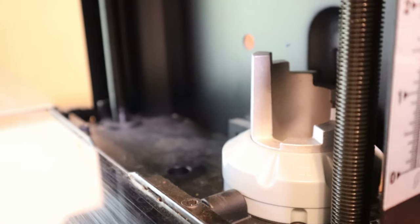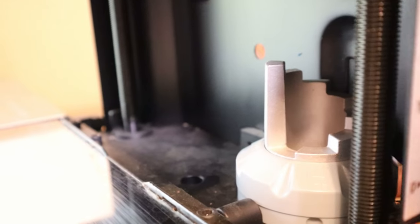Next thing is I wanted to show you the actual repeat depth of cut indicator mechanism. So this is the unit here. It's really solid, one piece construction, and it's in line with the bed, as I mentioned in the video. You can see why this is so trustworthy. There's nothing to adjust. It's just a solid piece, and I think there are 8 adjustments on here, so you're going from 1/8 of an inch all the way up to, so there's 9, 1 3/4 of an inch.